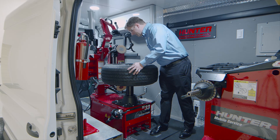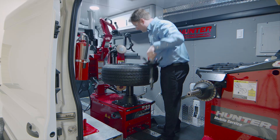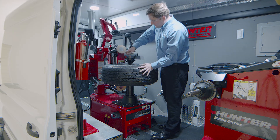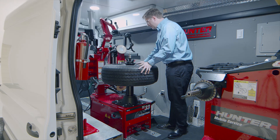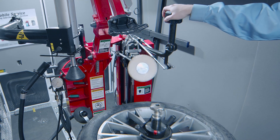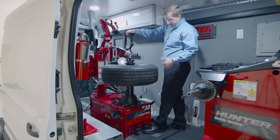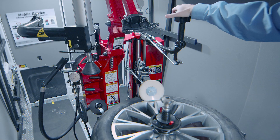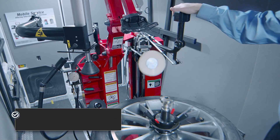It's a center clamp style, so I'll mount on the platen here, engage one of the traction pins with the lug hole, and clamp it up. Roller movements are synchronized, so I'll set everything off that top roller. When I press the second stage of the button, it will start to break that bead. I'm bead breaking counterclockwise here, which is important — I'll explain why in a minute.